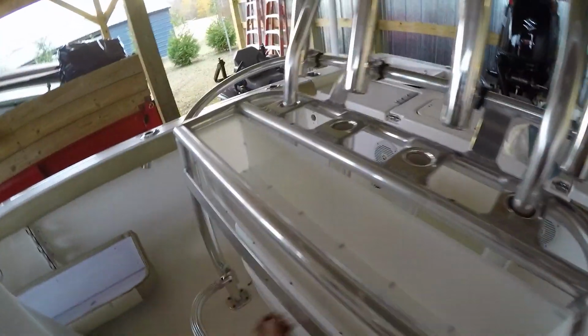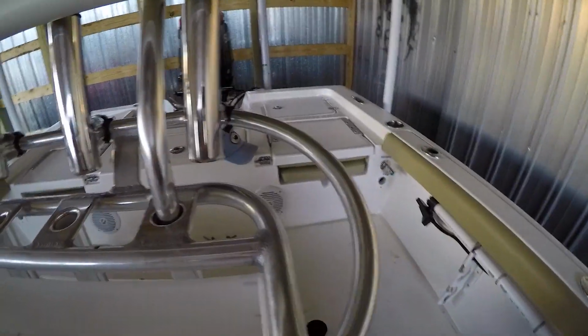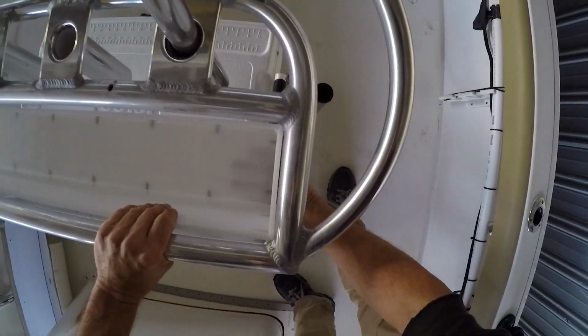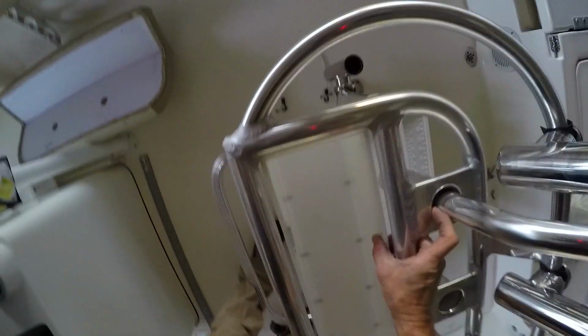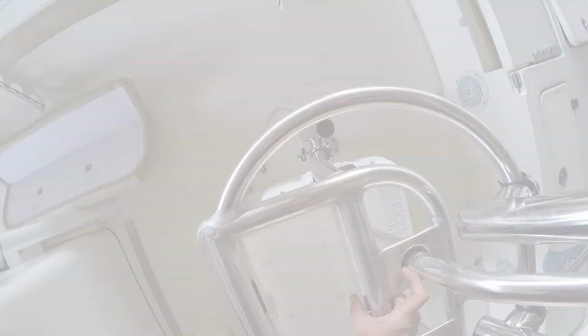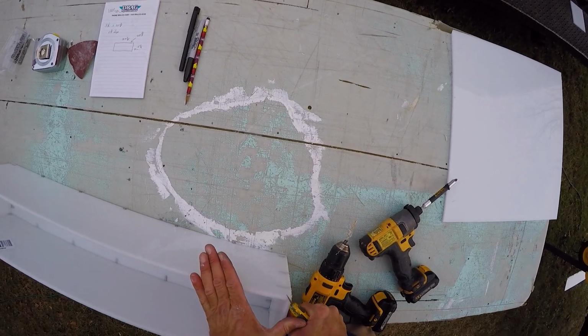So the welds in the corners are basically causing a clearance issue. Yeah, so our dimensions are good. I'm gonna have to shave down these corners and relocate these top screws for it to clear those welds, and basically 45 these corners.